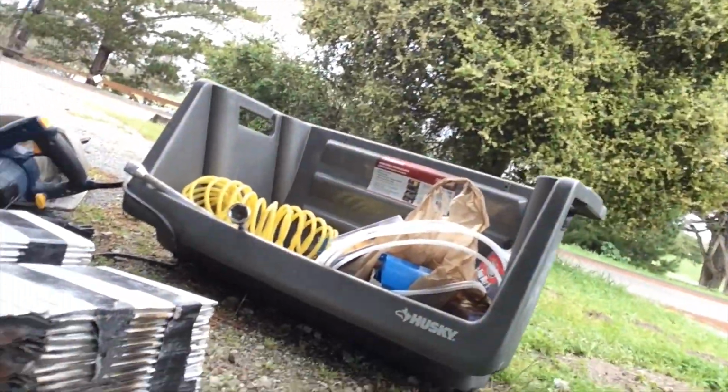To be fair, I'm fairly hopeful with these things, because they've been holding for a few weeks now as they've been sitting there balanced. If there was a cell that was dead and it was drawing, there's a chance that would have pulled down the rest of the cells, because I have 13 in parallel, if you noticed. So 13 times 4, it would probably have pulled some of them down, but they're all pretty well balanced. I'm not sure exactly if that's true, because a dead cell might not actually have any draw at all, so it might not affect too much. But just the fact that the pack has been balanced leads me to believe it'll be okay. I'm going to pull them all apart and test them just to make sure.